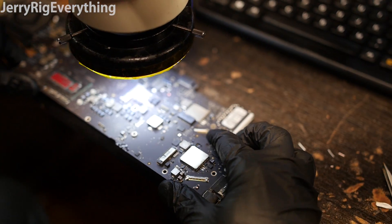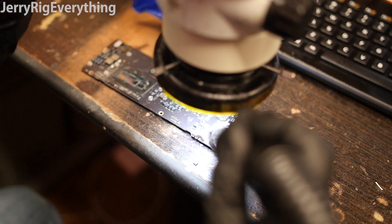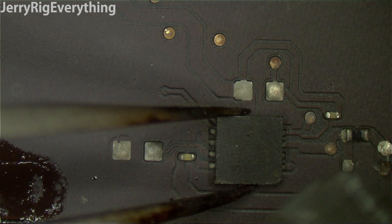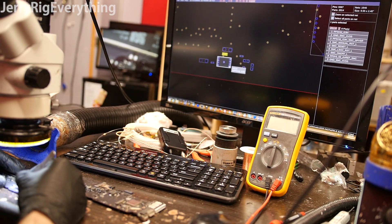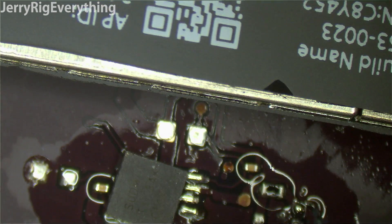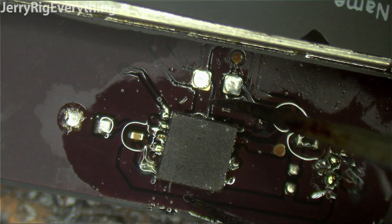We're going to take the chip off of one of my trusty donor boards. It's a beautiful donor board right here, so we're going to remove the chip from this board. The way I know orientation is that pin one is over here, and there's a little dot on the chip right over here that gives away that that's pin one.